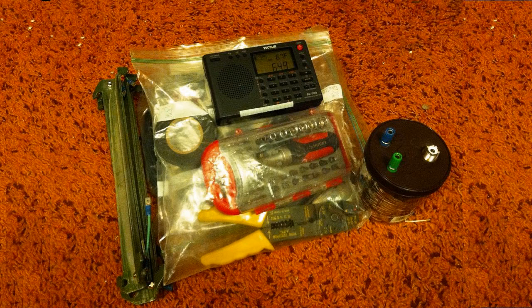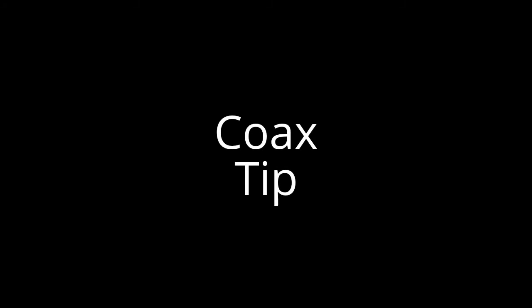The last picture shows my portable antenna packed for travel. This consists of two ziplock bags containing all the wires, tools, tape, and the radio. Next to it you can see the grounding rods and the balun. The only thing missing is the common mode choke, which is a standard four-by-four inch electrical box.